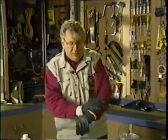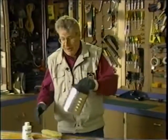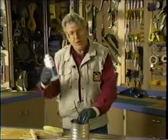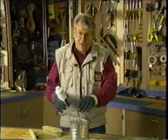Well, Dave, that's why I got my rubber gloves on, because we're going to get right at it. Always make sure those sleeves are down over your gloves, and wear protective eyewear, because we're going to use acid — muriatic acid. Take a pail. Take two-thirds of water to one-third muriatic acid. Always mix the acid into the water, never the other way around.